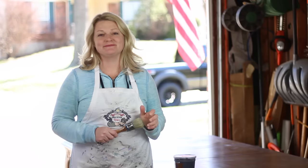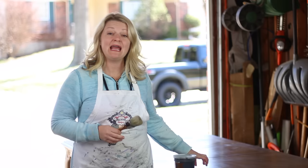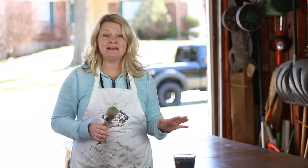Now it's time to paint. I'm going to be painting this dining room set with chalk paint, painting by hand. A very important tool when chalk painting is your brushes — using quality brushes creates a quality finish. I only paint chalk paint with chalk paint brushes. These are natural bristle brushes in an oval round shape with a very large head that spread the paint very evenly, with a lot less work in a lot shorter amount of time. Normally with chalk paint you don't have to sand to prep, but we had to sand this tabletop because of the broken-up finish, and you do always need to clean.